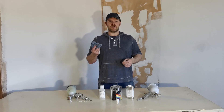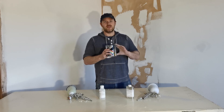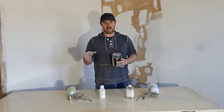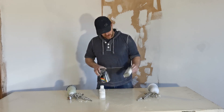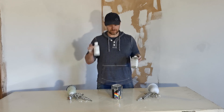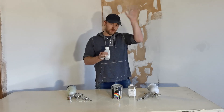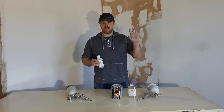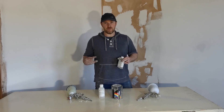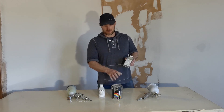And if you want, you could even use a sock — no, don't use a sock. This stuff comes ready to use; you don't have to water it down. You can use it straight on the plastic with a bit of prep, and we're going to go through that just now. The other things you get are the window prep and the vinyl clean. First, you put the vinyl clean down into a solution to clean the window and get all the grime off. Then you give it a scuff with a scuff pad to give it a key, clean it with the window prep, and then spray it.